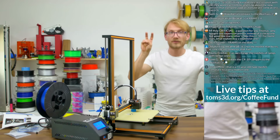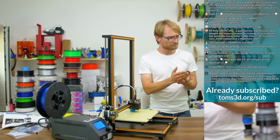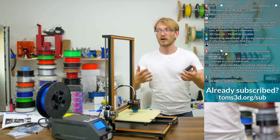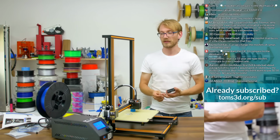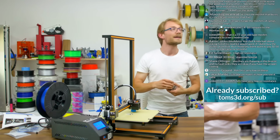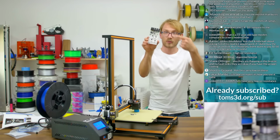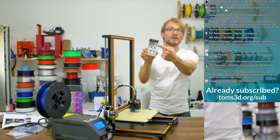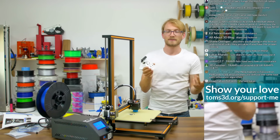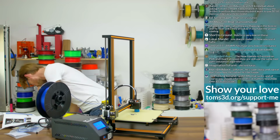Sure, if you use an external MOSFET that basically beefs up your power path from the power supply to the heated bed, then of course that is a marketing effective solution to saying, oh yeah, we use an external MOSFET, we now have this super powerful solution, it's not gonna burn up. Of course, if you market it that way, people are gonna believe you. But this thing with a tiny MOSFET on it that is properly selected is better than that big external one because it just doesn't generate all that waste power in the first place that is making your MOSFET burn up.